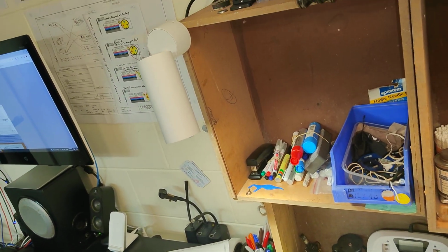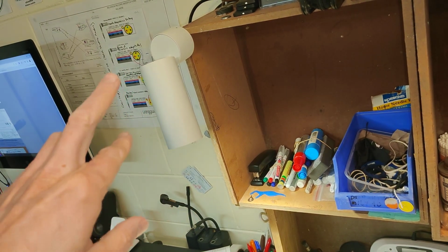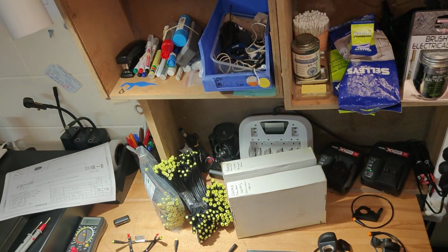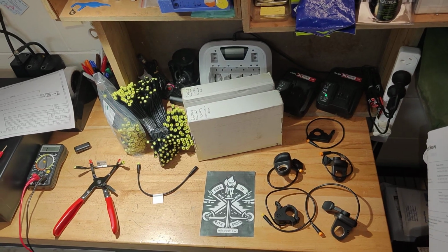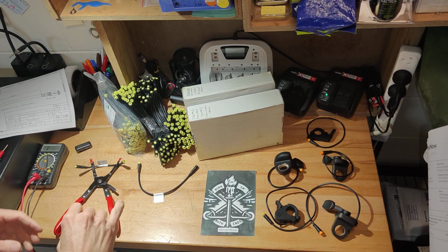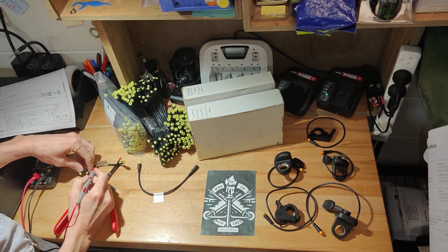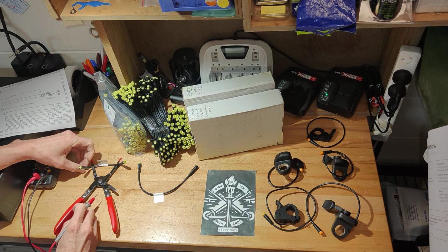I don't know if you've seen that diagram. That one there, so swapping that one to that one by crossing over the wire that's responsible for positive and throttle. The black, the third pin, stays the same. Unfortunately, that pin is the one that is opposite the notch. It's always a black negative. Just these two that we need to swap over.